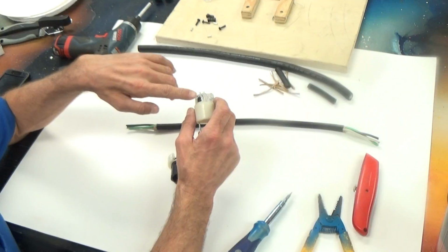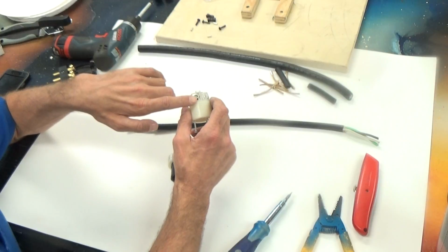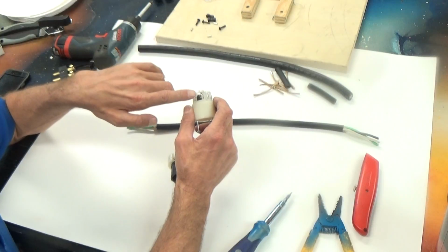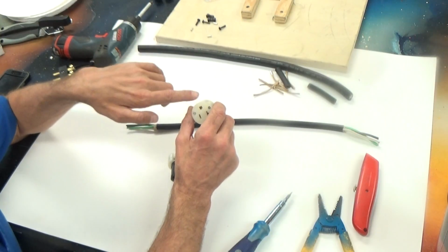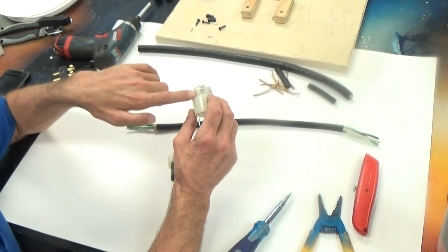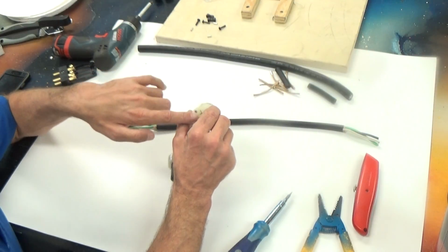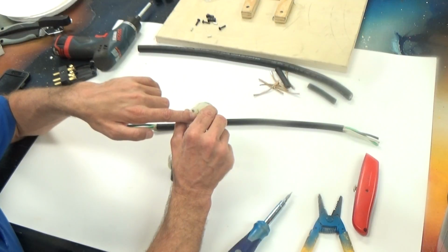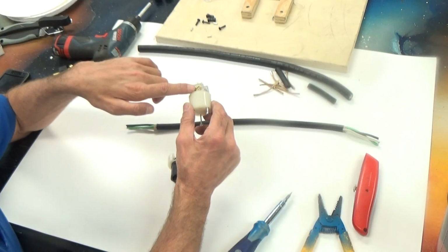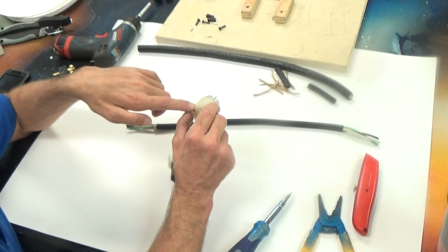As we look around at what the terminals are, there is a green set screw, and it usually is hexagonal. It has flat sides. That is ground, and that corresponds to the U ground pin of the connector. As we work our way around, we'll see a silver set screw that's round, and that corresponds to the widest blade of the connector, which is the common. And then as we continue around, we'll see a brass. The brass corresponds to the narrowest blade, which is the hot.